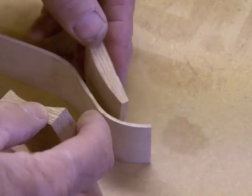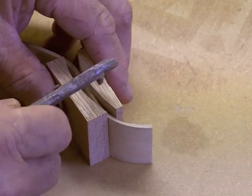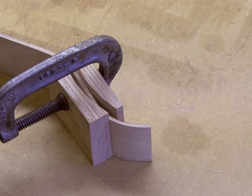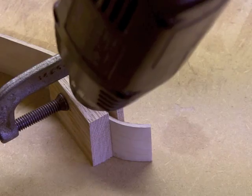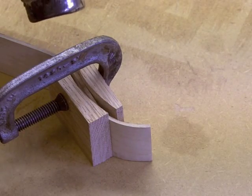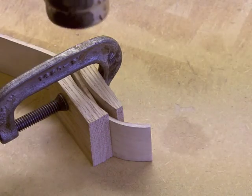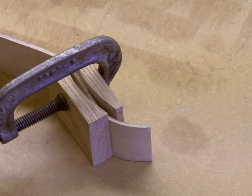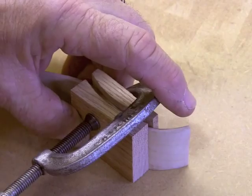If you need to make minor changes to the sides of the rib in any place, you can create a small caul from oak or maple and then lightly clamp it in place, leaving enough space to get some air in there. Use the heat gun again to apply warmth to that area of the rib. Keep the heat gun moving so you don't burn any one part — about 10 or 15 seconds will do it. Then just snug up the clamp and allow the part to cool for about 10 or 15 seconds.